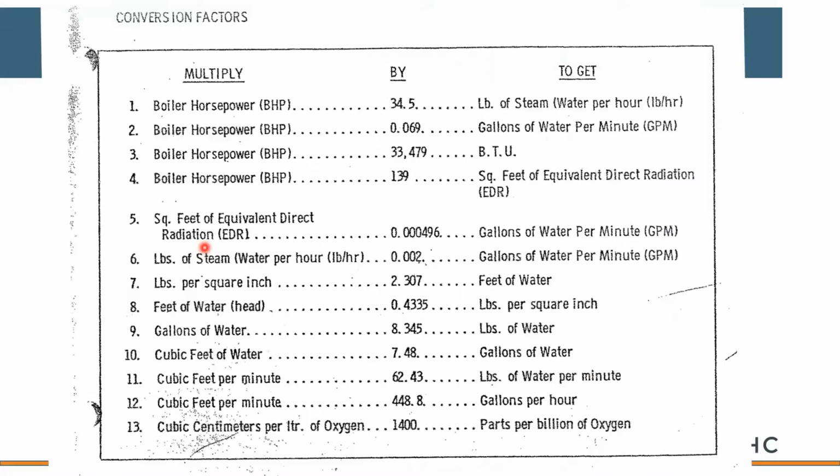We got lucky. One of the things I do when I'm working on a steam job is grab what I call a cheat sheet for conversion factors. It simply allows me to take some of those boiler horsepowers and convert them into BTUs that I'm comfortable with. On traps and condensate pumps, and also heat exchangers, you'll get condensate flow or steam flow in pounds an hour. For me, it's important to at least picture that in gallons per minute, so there are ways to convert it. Standard conversion factors are just a friendly reminder of taking some of those steam properties and getting them back into units that I understand or work with on a more regular basis.